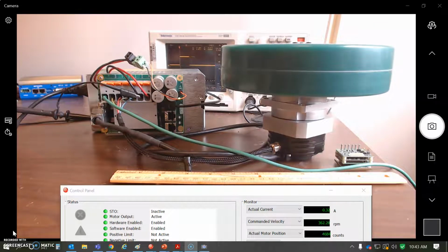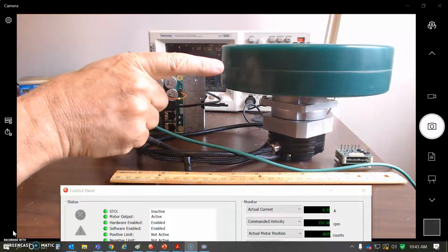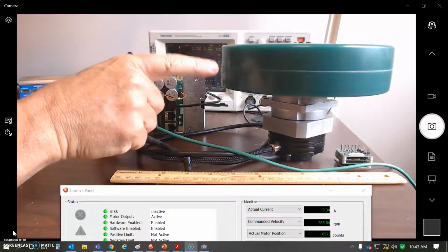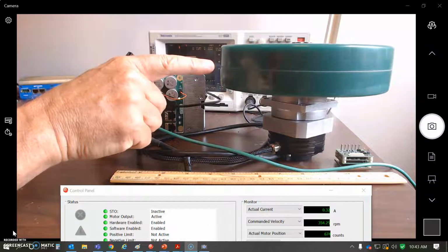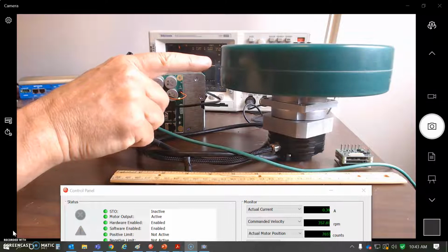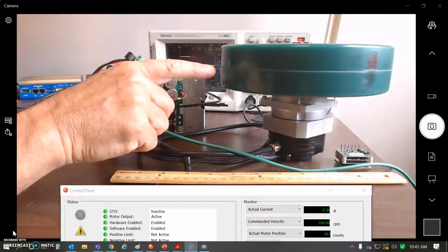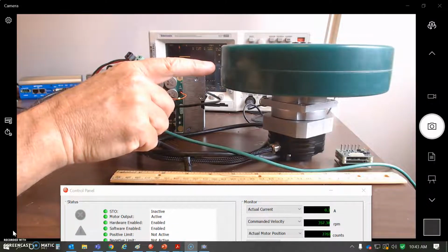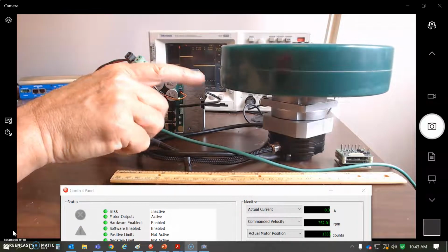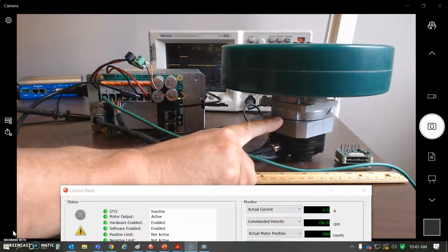So today I've got this really cool INFRANOR wheel motor for an AGV. This would deliver power, 200 millimeter diameter, and 0 to 2 meters a second, running at about 2,000 RPM at the motor. Probably do 4 meters a second, or 4,000 RPM at the motor. So this is a 10-to-1 gear.